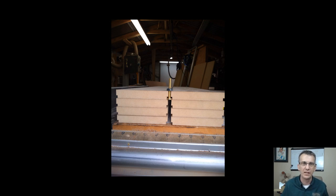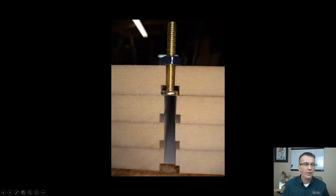So there's a lot of different ways to create the rabbets for these, and I chose to use the table saw. Now, for the rabbets from my pencil marks, I gave myself another 16th of an inch. So basically from the edge of one piece, I was 3/16 inch wide, and then from the bottom a quarter inch up. So basically my little rabbets were a quarter inch deep by 3/16 of an inch wide. And that gave it was versatile enough that my T-bolts could fit in there, my square nuts and things like that.